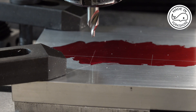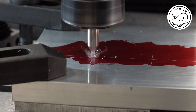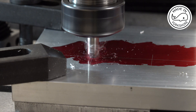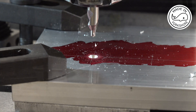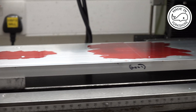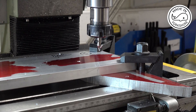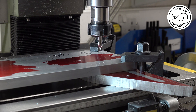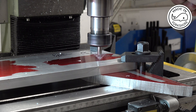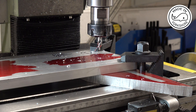I've moved the X and Y-axis by the desired amount and it looks like my marking up is spot on. I'm certainly starting to challenge the table limits of this WM18 milling machine — this hole is over 400 millimetres from the first one — but it's still in line with my marking up, which is encouraging.